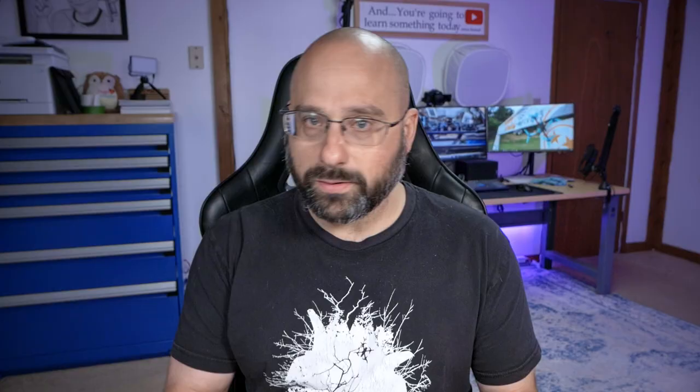The next thing is to plug the antenna into the video transmitter, but first an important warning: never power up an analog video transmitter with the antenna uninstalled — whether it's popped out of the connector, unscrewed, or the wire is broken. If an analog video transmitter powers up with the antenna missing, it is likely to be permanently damaged, sometimes within five to thirty seconds. If your range seems really bad later, and you remember powering it up with no antenna, that's why.